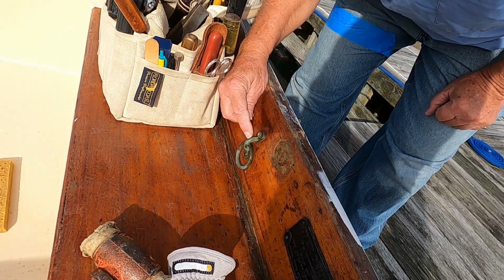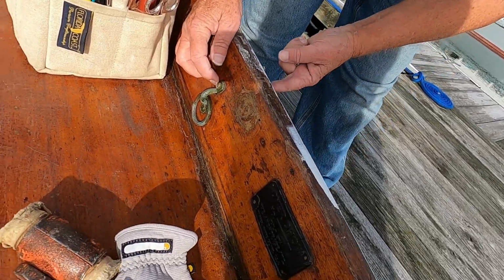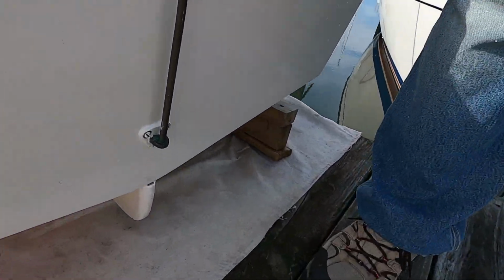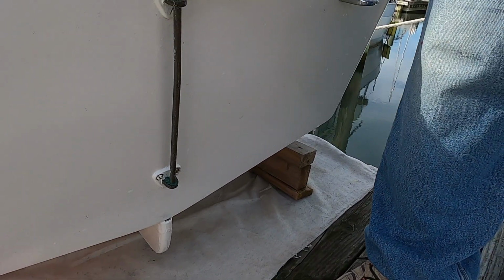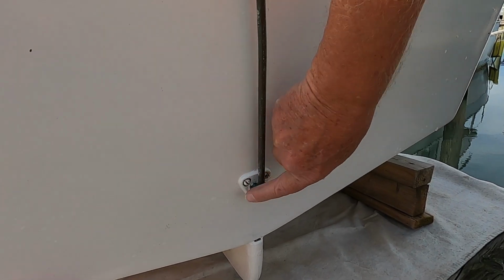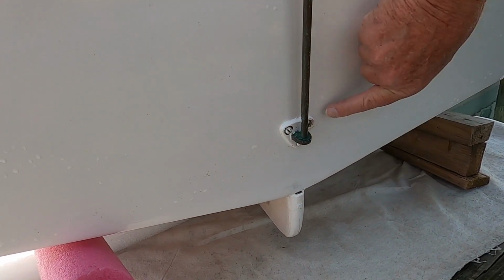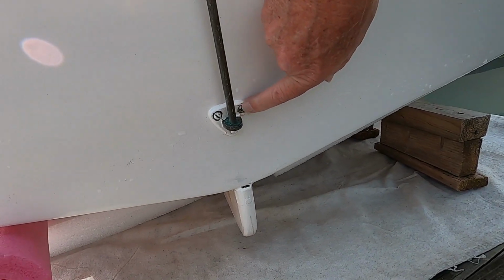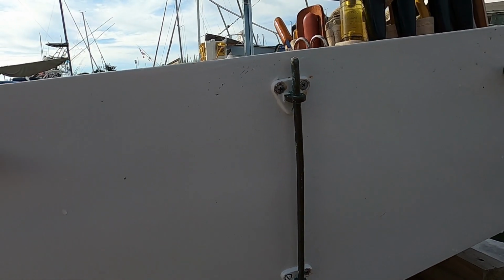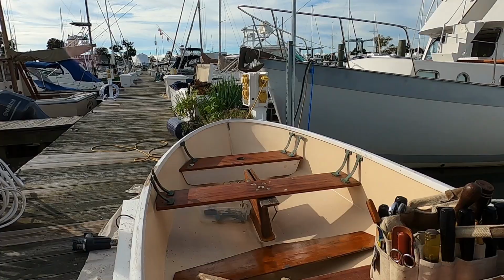And this is bronze with stainless with who the hell even knows. There's more on the rudder: stainless here with bronze, and now this is in contact with salt water. So we definitely want to swap these out. There's a slotted, there's a Phillips, Phillips, all mixed, just to keep it interesting. Makes a nice battery. But in general, this is a very nice boat.